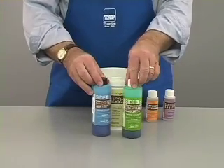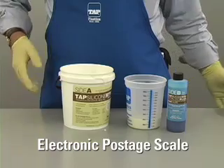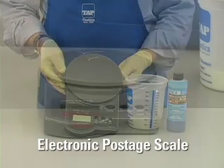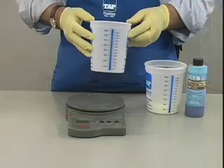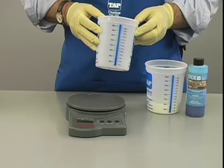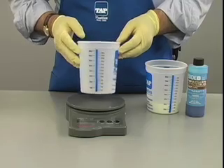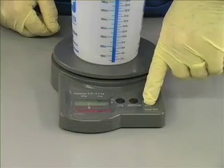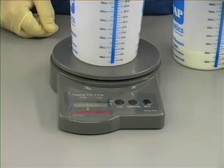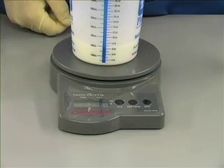Next, we add hardener. Measuring by weight is simplest and most accurate, however you will need a scale. We are using a simple electronic postage scale available from any office supply. It weighs in ounces and grams and we will use the gram setting for greatest accuracy. We have already measured the volume of silicone we need, so now we will weigh it. We want to weigh only the silicone, not the cup. We take an empty cup and put it on the scale, then turn the scale on and it sets the weight to zero with the cup in place. We also convert the weight to grams. Now we remove the empty cup and replace it with the cup containing silicone. The weight shown then will be for the silicone only.